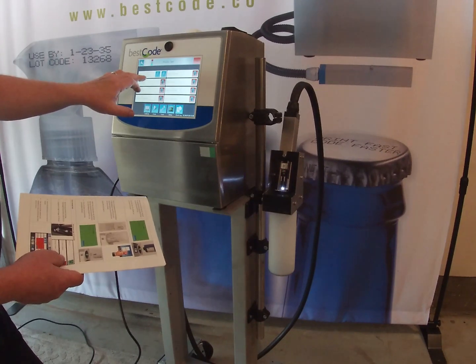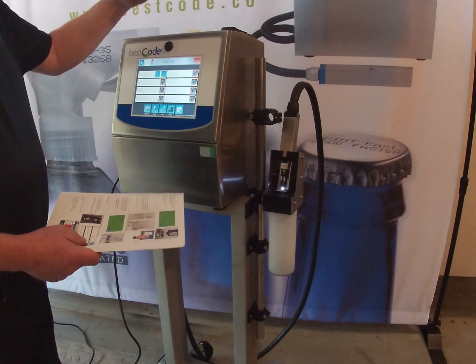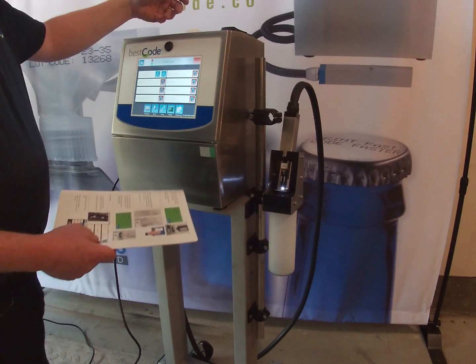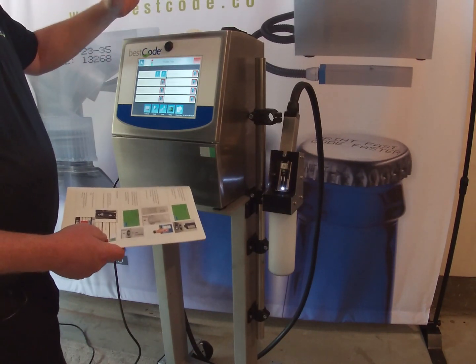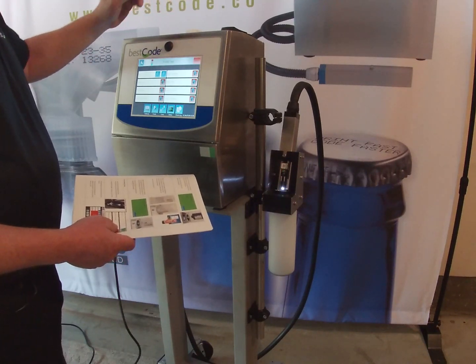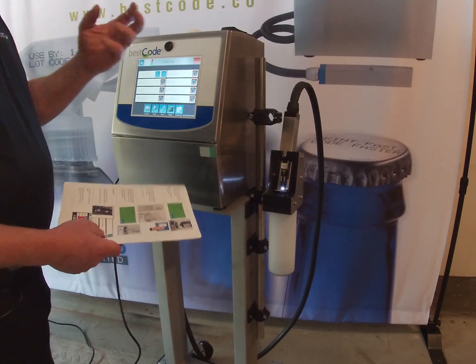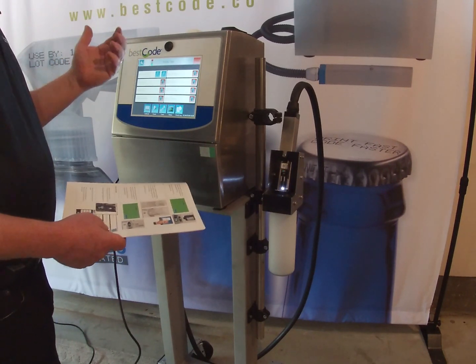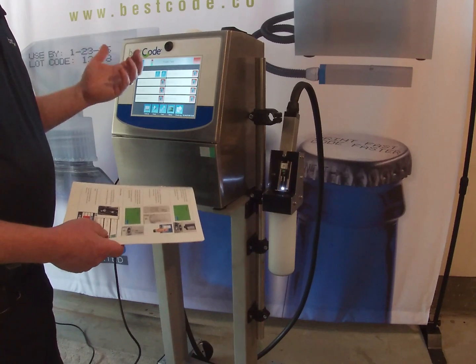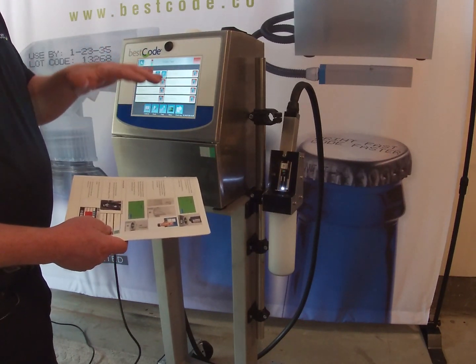You can see we're now at 7 RPS, 4 PSI. And what this is going to do is slowly put ink in the system, fill up the filter, that 10,000 hour filter, or whichever filter module you have in there, pull ink from the tank. It would load it through, going through all of the different components, like the Venturi, the viscometer, but it will slowly fill this up.